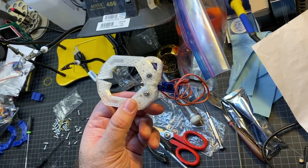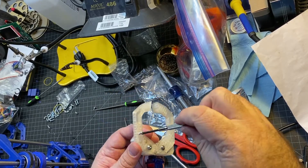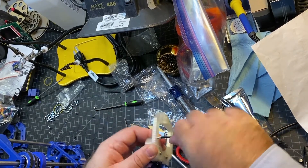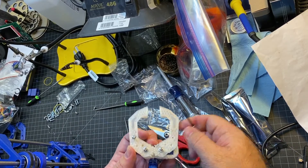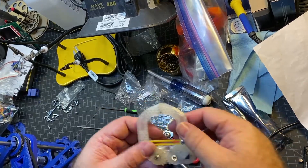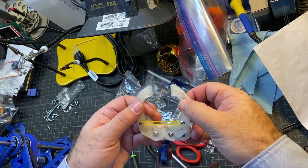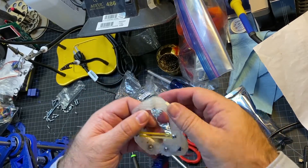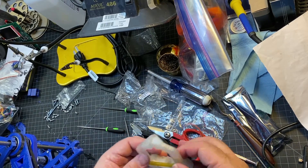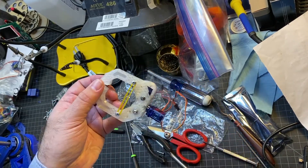The next step is going to be setting it on the arm. Before I put the gripper on the arm, I'm going to secure a couple of M3 6mm screws — these are going to be used for the rubber band. You just put one on either side in these two holes. I've got the rubber bands on now — you can see those definitely close pretty well. There's also some foam that gets cut and put on the edges. Seems to be moving good with nothing catching it.